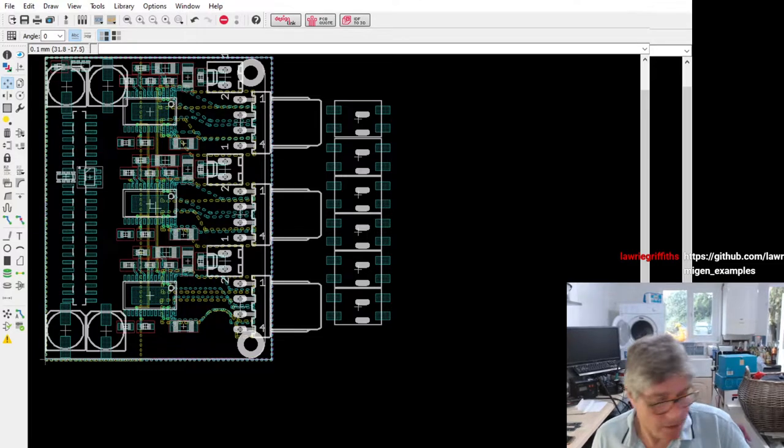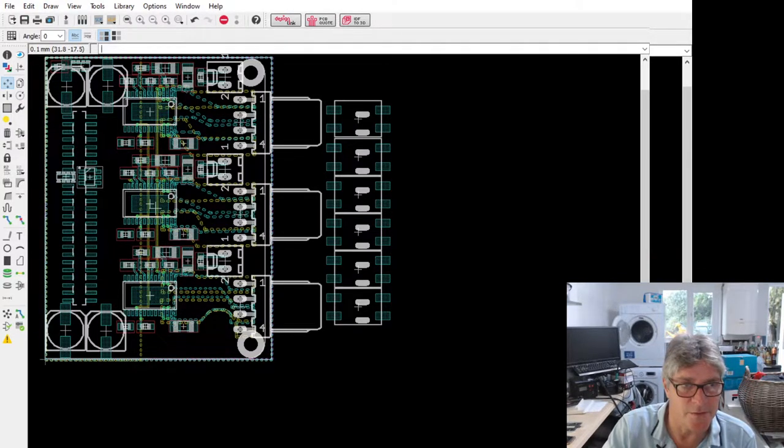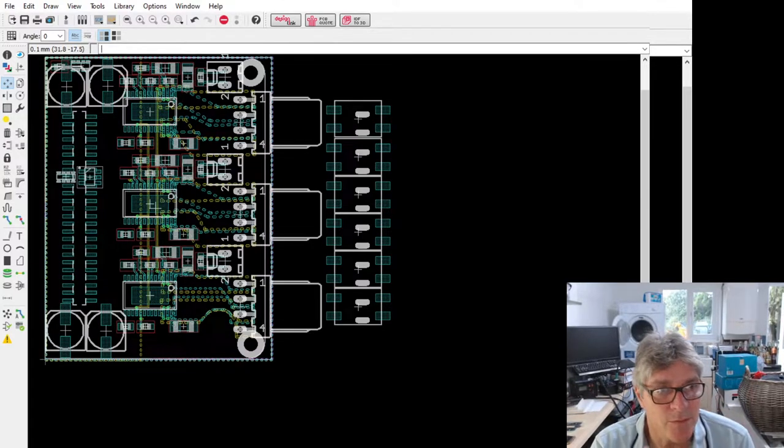Thanks, Laurie. And this week we were talking about quad SPI, dual SPI, and SPI. Laurie's been doing quite a bit of stuff using Wishbone, which is a bus, and that gives you a standard way to address peripherals that you're designing in the FPGA, and to control the communication to and from them. One of the things that would be useful is to have an interface to the Wishbone using SPI, dual SPI, maybe quad SPI, and then later we're adding FMC as well, the ECP5 version later.